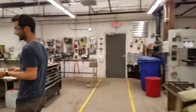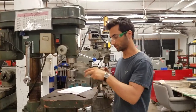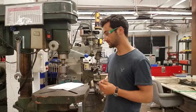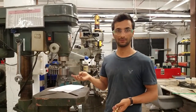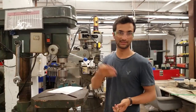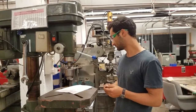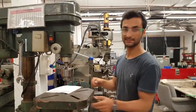Another accessory you can use is a vise. In the wood shop it's occasionally okay to drill while holding the piece by hand, but in the metal shop that is never okay. You always need to make sure the piece is clamped by something other than your hands. If the material came loose, this is a huge motor and a piece of metal could seriously injure you. There's a lot of force involved in cutting metal, so clamping directly to the table with clamps is great.